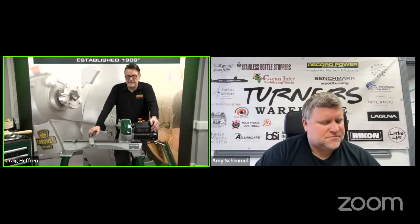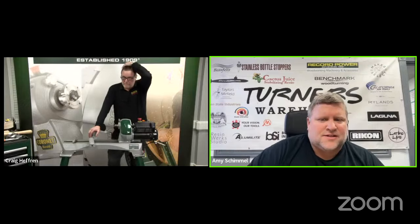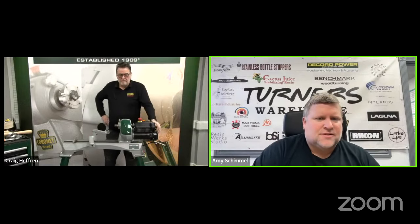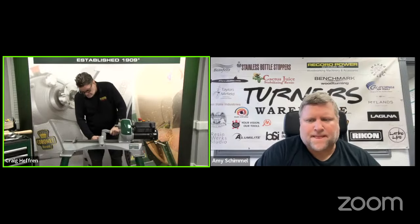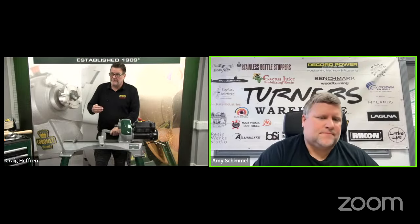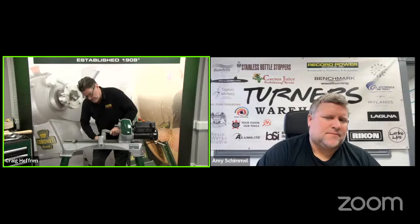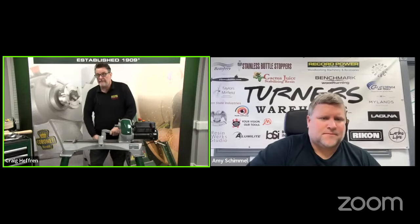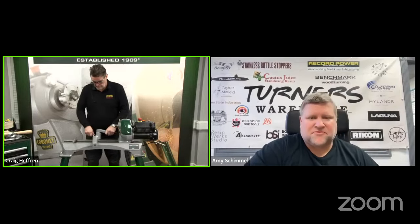Yeah, excellent. Well, I think that banjo question relates to all lathes. If you get that spongy banjo handle, it just needs that little bit of maintenance. And obviously, when you've done that as well, Chad, sometimes just a quarter of a turn on the nut after you've cleaned it up will give you a different position of your handle to go through. If it's too loose, you can actually drive through the cam. So a quarter of a turn sometimes makes a lot of difference on the nut. Very good.